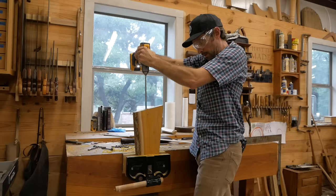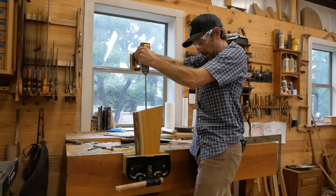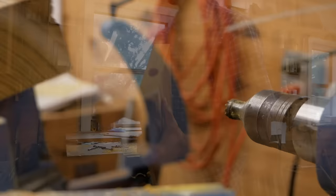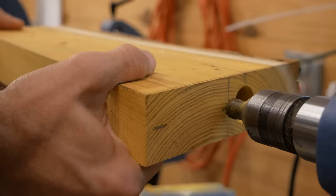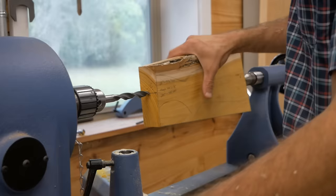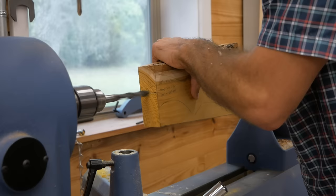I've got to drill three different size holes. The first one holds the bolt and the washer, and I have to extend it — I don't have enough length in that Forstner bit, so I do it by hand and try to keep it as straight as possible to the depth I need. Then I come back from the other direction with two different size holes: one just large enough for the bolt to pass through, and the other for a recessed nut that comes down from the receiver of the 16 gauge. I drill the bigger hole first, then finish with the smaller size.